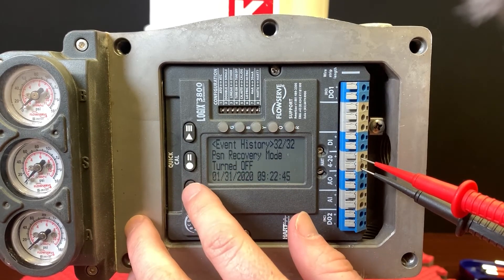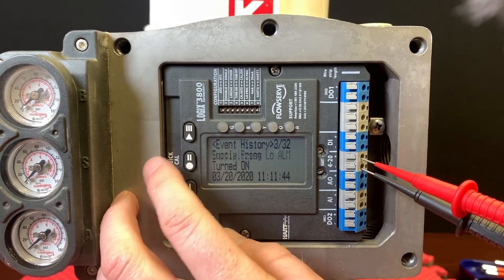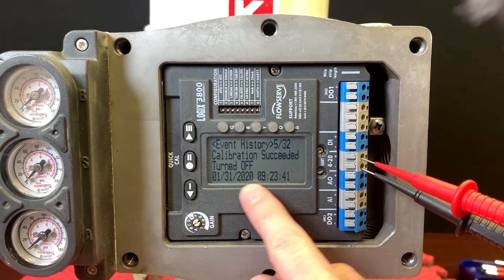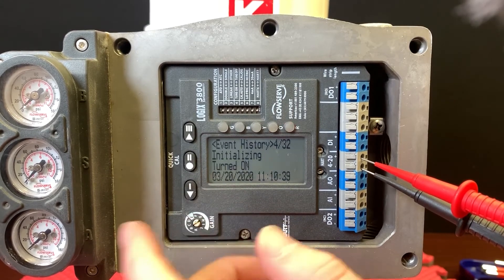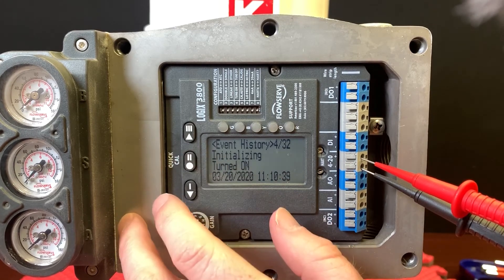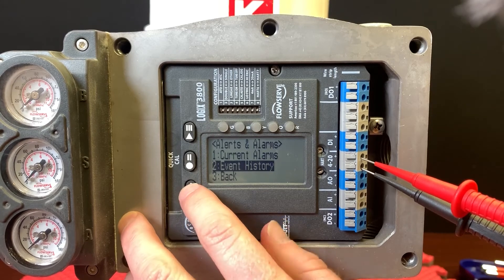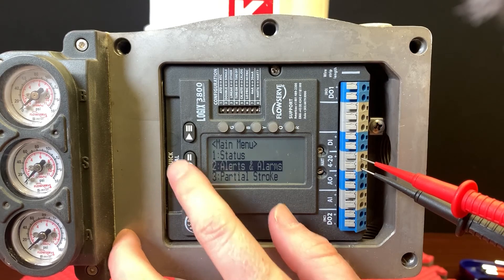As we look down, we can see in the event history the different things showing up in terms of alarms. Supply pressure low — it was turned on here. You can see there's an internal clock keeping track of the time frames when all these different things happened, so it gives you a backup to record events. If something happens, you can verify it — those questions of 'did someone mess with this thing' — this interface provides a lot more information and details on what may or may not be going on with your valve.